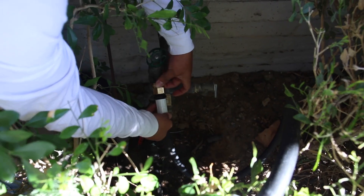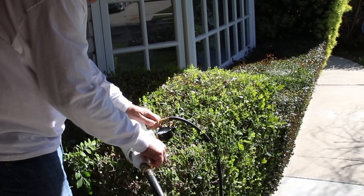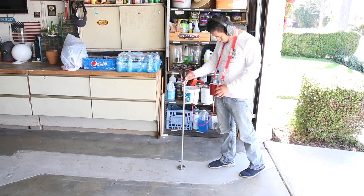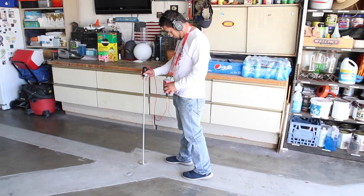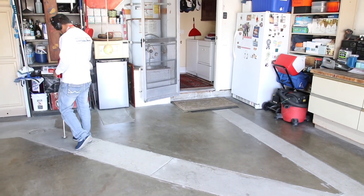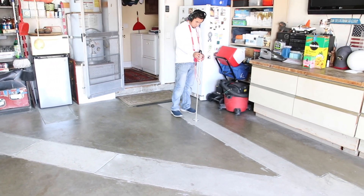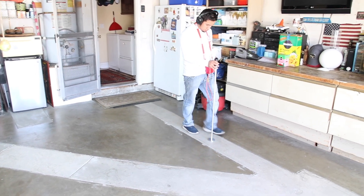We heard the leak on the cold water side, so next we pump it up with air and water. We hook it up to the hose bib outside the house on the cold water side and inject it with air and water. We're listening to the previous repair — a lot of times we find leaks where something was previously done. We're starting to pick it up, but we keep listening on the whole entire pipe. We know we have something going on on the cold water side going up by the hot water heater. This is the way to confirm what we actually heard. It's not as loud at first, but getting back closer, it gets louder.